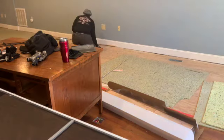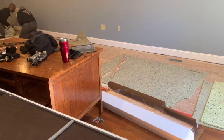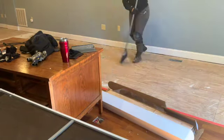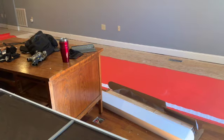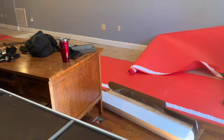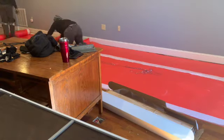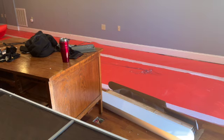We're taking up the rest of the carpet and pad, sweeping up. When doing a floating floor — especially laminate or hardwood — you always have to put underlayment under it. Some laminates already have it attached, and most vinyl planks do too, but most engineered floors don't, so you have to add it. What floor muffler does is when you walk over the floor, it sounds like you're walking on a solid wood floor — it gives it that solid sound underfoot.